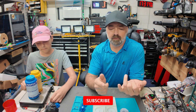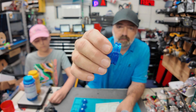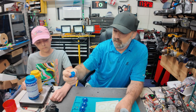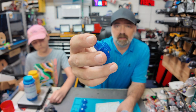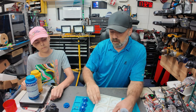First, you have to design your rim. Carter designed this one in Fusion. You can see it has a little groove to keep the tires from slipping off the sides, and little keyways cut out to help keep the rubber on. These are made out of TPU and they have a pulley on it for the belt drive for four-wheel drive. Then he designed the mold.